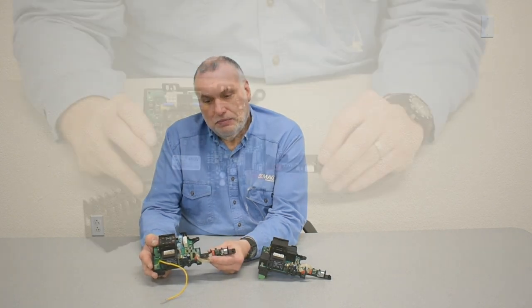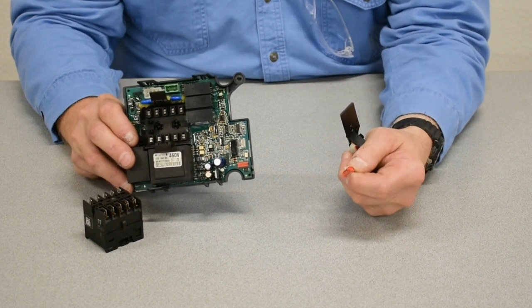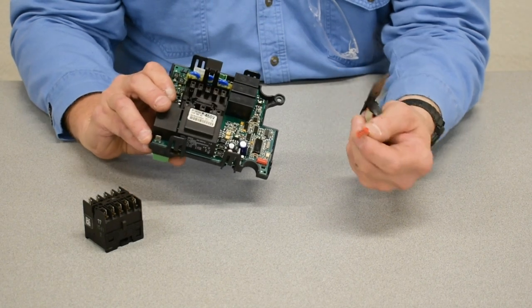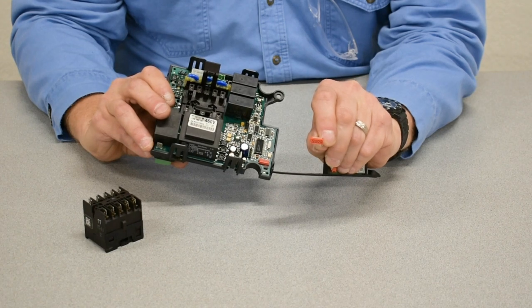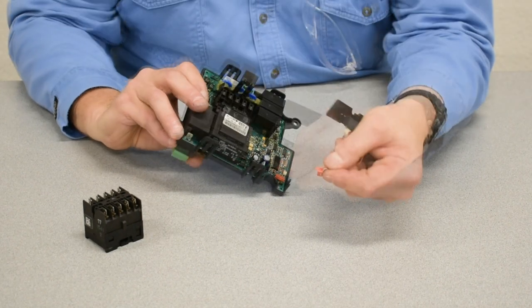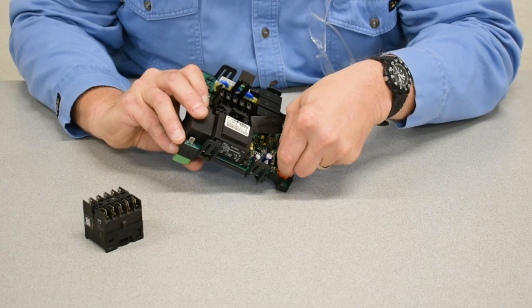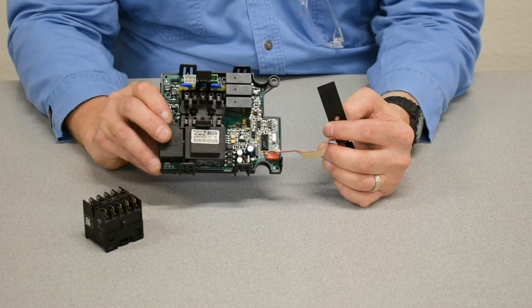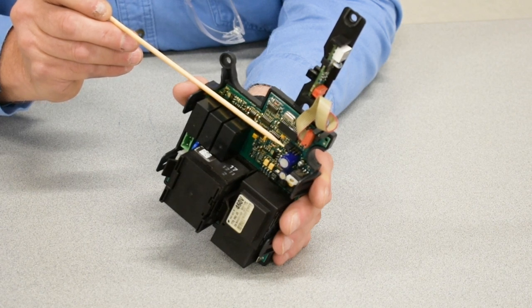The arm is plugged into the main board with a red connector. Be very cautious of that little red tab when you disassemble and re-plug. It's better to not ever touch it, but if you have to, make sure you orient that tab in the proper direction and plug it together. In 2010, comms were also painted blue to match the Pro.